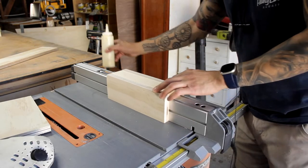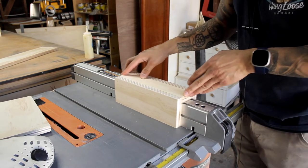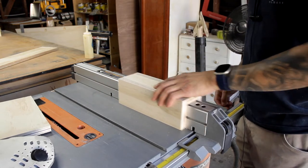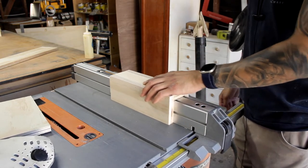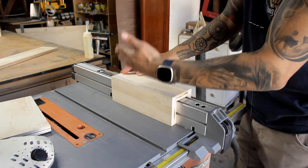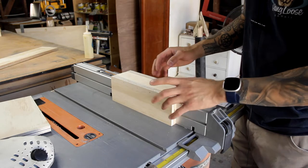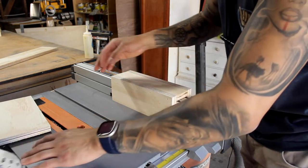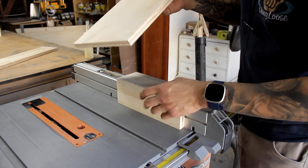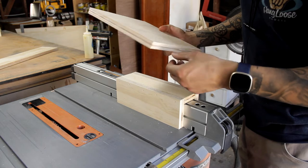This is looking good. It's all glued up. I added some brad nails — I don't know why I was saying pins earlier. It's sliding nicely and there's no slop left or right. Next we just have to add the face here — another scrap piece of plywood — and that's what you're actually going to clamp your work pieces to. I went ahead and cut it out already, cut it the same length as this: 10 inches. To make it easy, I made it 10 by 10.